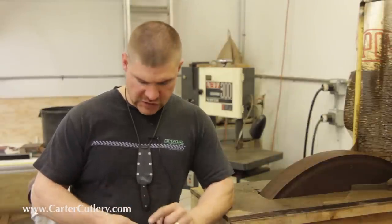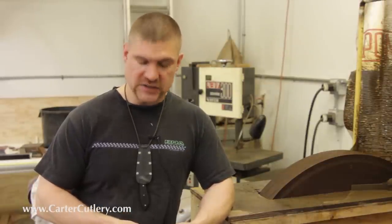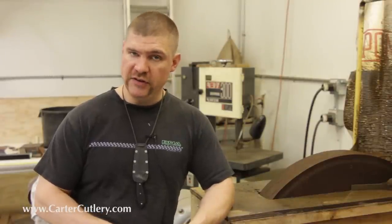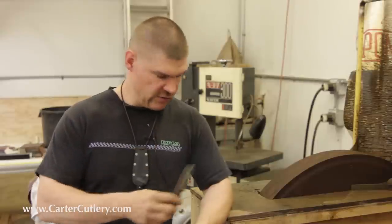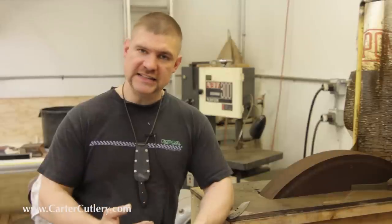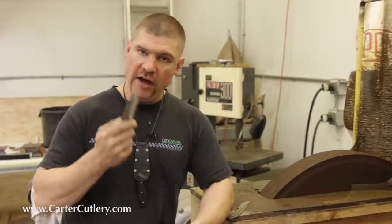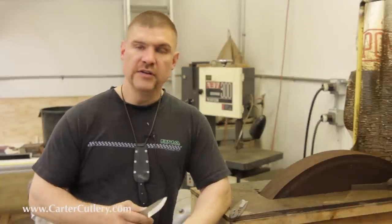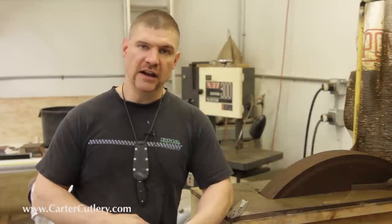Now, looking at these blades from the spine, because they're all hand forged, I can see they're of varying thickness. So, because hollow grinding removes the most amount of material away from the secondary edge, I'm going to choose the thickest knife for the hollow grind. And because a convex edge grinding removes the least amount of material and is the strongest kind of edge, I'm going to put the convex edge on the thinnest knife, and I'm going to put a flat grind on the middle size, middle thickness blade. Okay, follow me over to my grinders and we'll get underway.